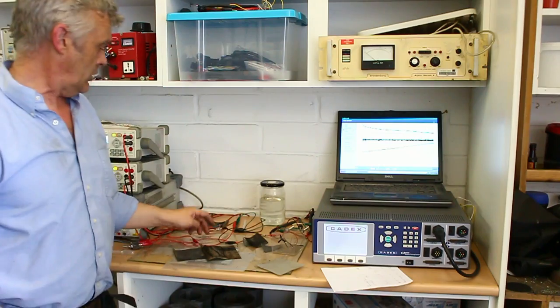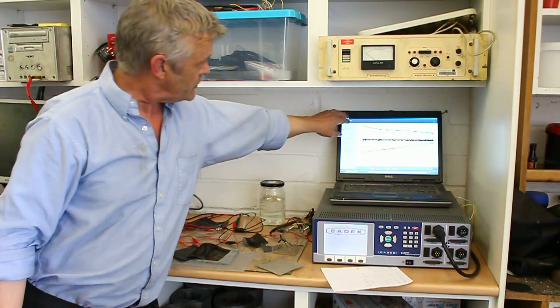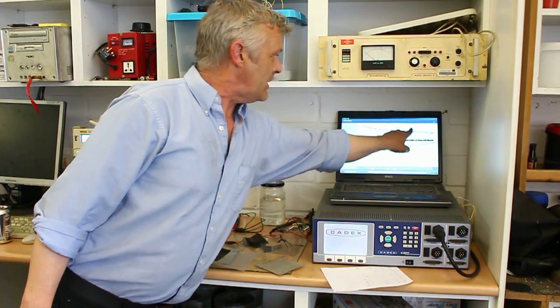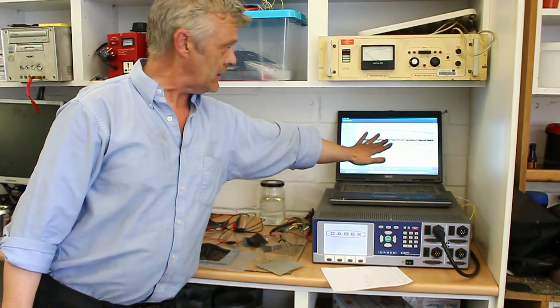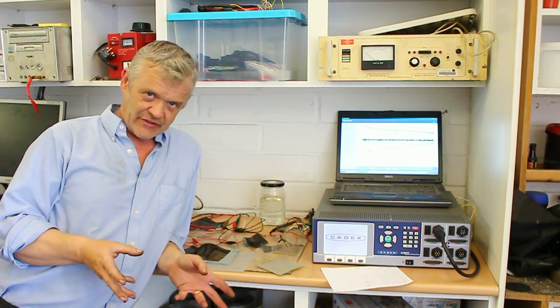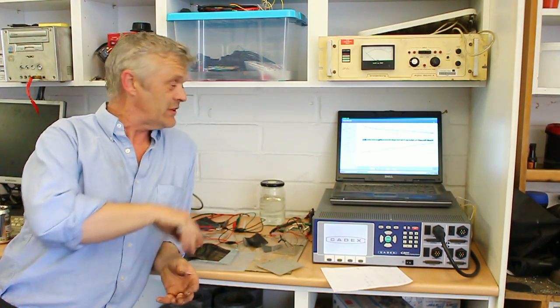Okay, so this one we're looking at this device here, and that's actually quite a strange device. You can see this drop off here, then a kind of long tail off, and then a drop here, and that's actually much more battery-like in its behaviour. The reason it's like that is because it is in fact a pseudocapacitor. It's an asymmetric capacitor design using old tyres on one end and a different material on the other side, kind of mimicking an asymmetric capacitor.